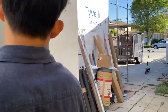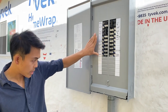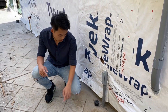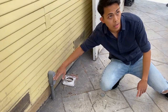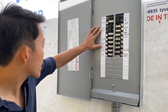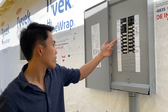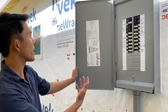This is what the main electric panel looks like. It used to be inside; we moved it to outside the house. This draws power from the main electric panel on the main house. There's a conduit that runs under the house — this was done before the concrete was laid — and it goes back into the main house over to the main electric panel on the other side, through the crawl space. This electric panel has 20-amp and 30-amp breakers labeled. The difference is some appliances use more power — the water heater, washer, and dryer take 30-amp circuits, while some take 15 or 20. Different circuits for the living room, island, bedroom, refrigerator, and so on.